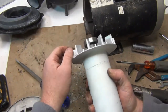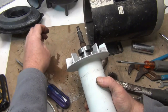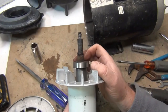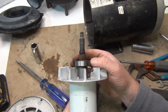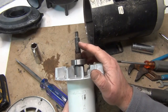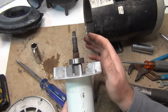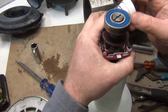That shaft's pretty bad, so keep an eye on it — make sure it's straight before you put anything back together. Do a yearly check-over of your hot tub to see if your seals are leaking, because it's a leaking seal that wrecks the pump. If you want it to last longer, just keep an eye on it.